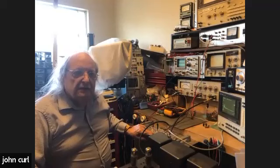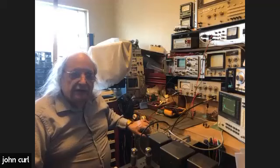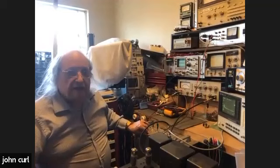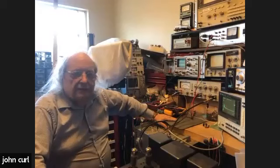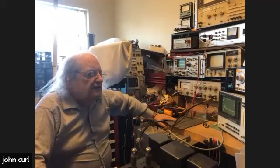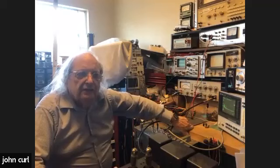And I think he went too far, because if you don't use any feedback and you need the feedback, the distortion will become so high, just open loop, that you'll hear it as regular distortion. You know something's wrong. It's muddled, or it's not clear, or I hear something I shouldn't hear. But the human ear is pretty tolerant of several percent distortion. It really is. If it wasn't so insensitive to lower order distortion, like the second and the third, we would never have been able to use analog tape, even from the get-go. All those analog recordings would sound like heck.